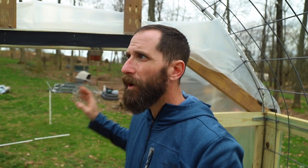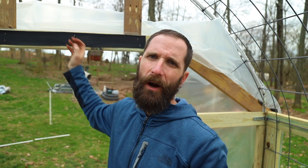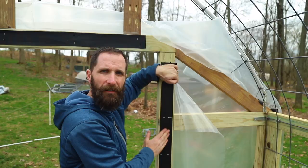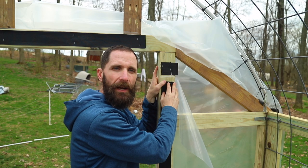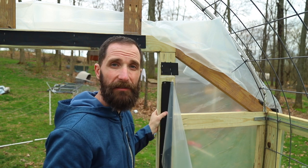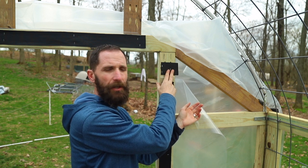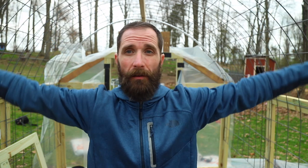I struggled a little bit as to what to do with our doorway. I was just going to put wiggle wire on the inside, fold the plastic over, and tack it in here. Instead, I have wiggle wire on the outside but not on the door frame itself, so it just wraps around the door. Then I use this strapping — it's almost like a seatbelt-type strapping, but it's actually made for this application in greenhouses. You staple the plastic into the wood; the strapping helps keep the plastic from moving and the staples from ripping holes in it. Should last a really long time. Now you can see I screwed up here, so I have this little piece — I don't know if it's going to work or not.